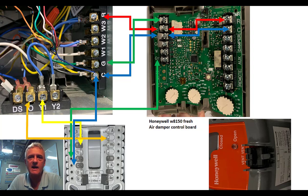Here we're simply — self-explanatory — taking O from the air handler and bringing it to the O terminal in the thermostat. We don't have an outdoor unit in this drawing, but we do have everything else. O out of the thermostat, for your reversing valve, bring it over and put it on the O terminal.